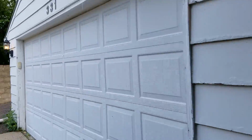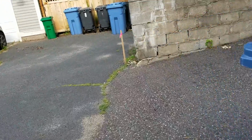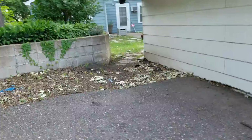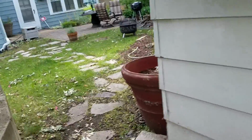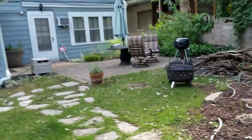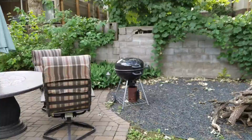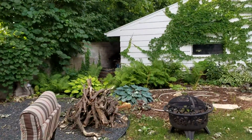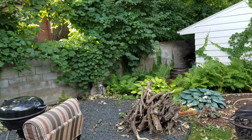It's 44 feet from the point of that garage to where that crack was in the wall that I said. So it's 44 feet. We'll bid 2 5-foot returns. This is all going to be 48 inches tall. But Jack is the one that gets to do all the demo for that. So we need to get Jack out here to take a peek at it. You can show him this video if you want, or I can walk him through it.